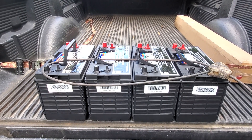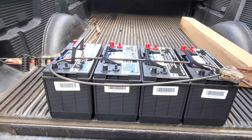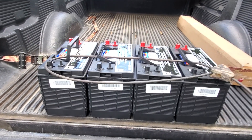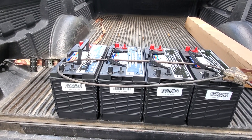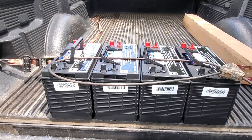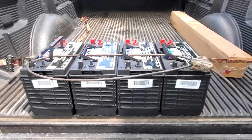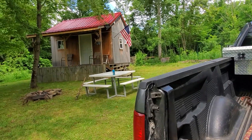This is going to give me — I'm going to run two in series to make them 24 volts, and then parallel, so what I'll wind up with is a 24-volt, 210 amp-hour battery bank. And that's going to be more than sufficient for what I need to run out here, especially for my weekends.